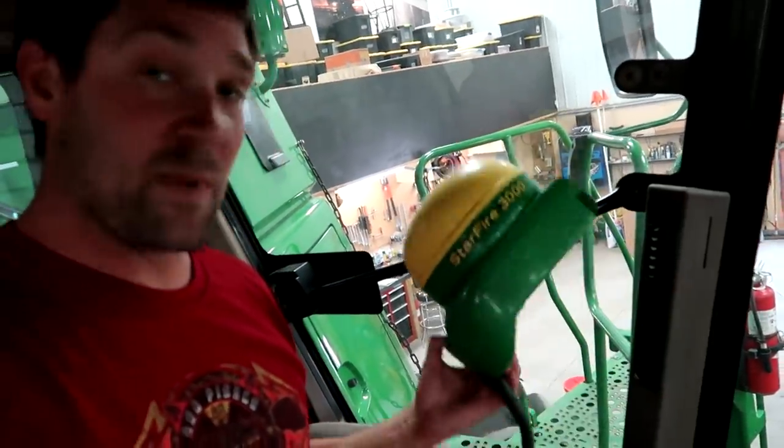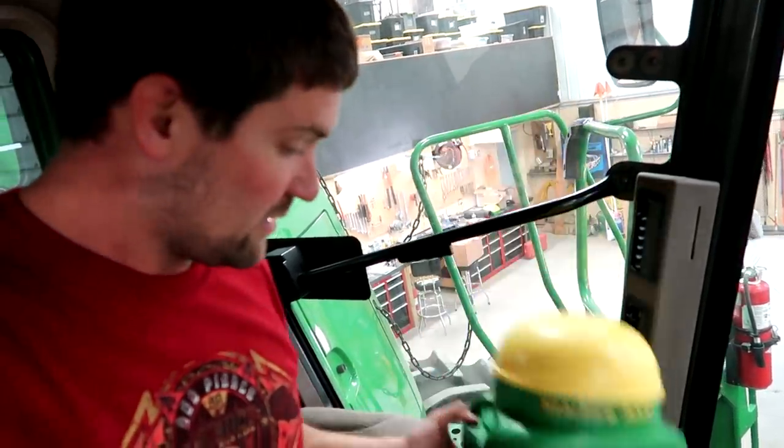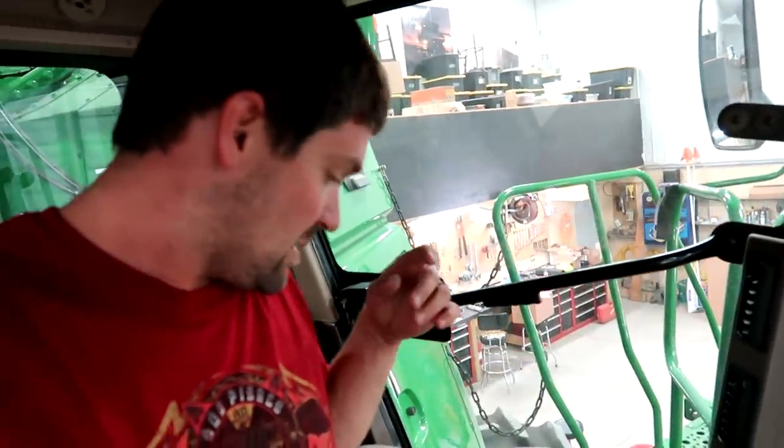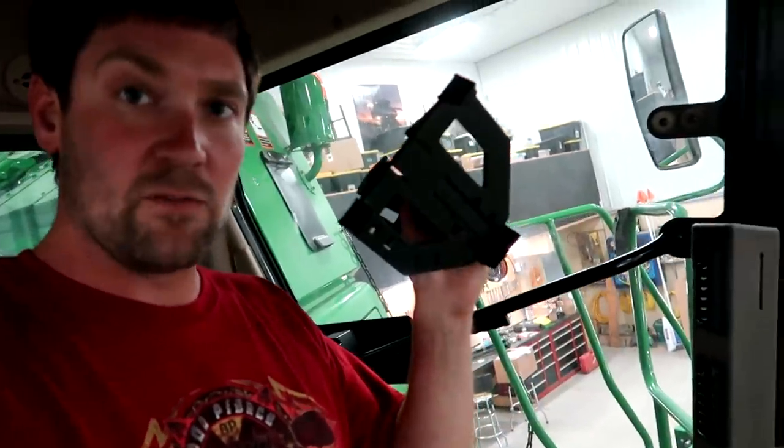Tom got back to me and said that the only thing we need to update is the newest receiver we have, which is not the one that will be run on this machine, so I can install all this — we're good to go. Here's my RAM mount for our Field View that we're going to put in over here. I just have to bolt that to the corner post. That just takes a simple standard iPad to be installed at a later date, along with a Bluetooth puck that goes back here to read the data from the machine.